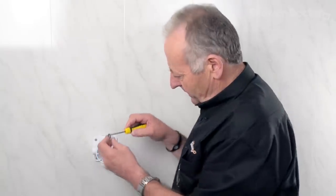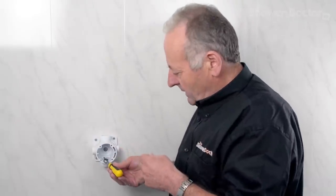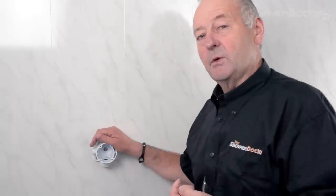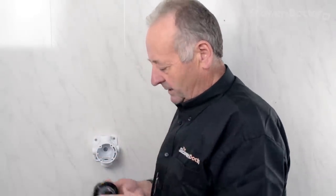When it comes to replacing the O-ring, your best plan is to balance it on the end of a flat blade screwdriver and then push it into the groove. It's not always necessary to replace it, but if there's any problem with the cartridge and you phone back saying it isn't working properly, the first question you'll be asked is whether you replaced that O-ring. If you haven't, you'll need to replace it before any parts can be taken back. Normally you don't need to replace it.